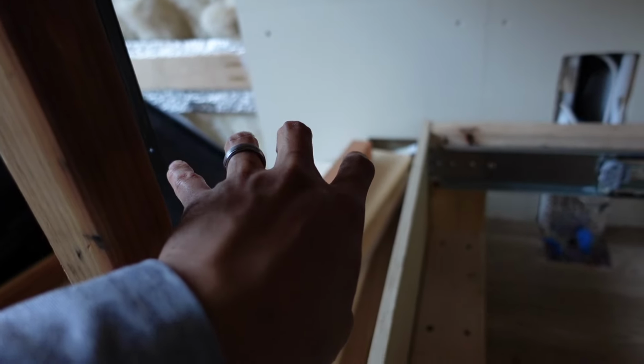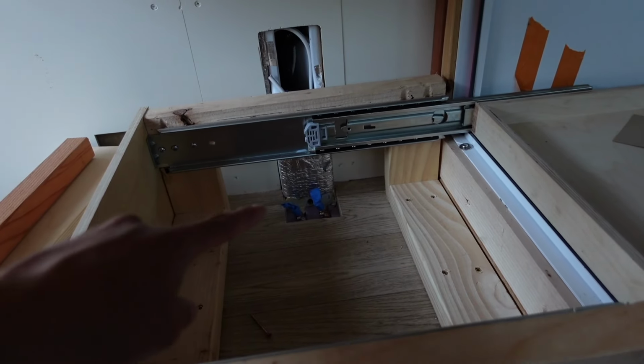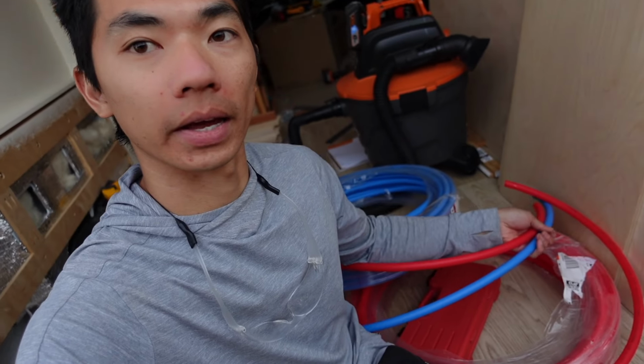Cold water runs into the heater, which is under here. Then that gives us both hot and cold supplies. It'll tee off from here. So one side will go towards our galley sink, towards me. Then the other side will kind of climb up through here, up through this little hole, which I'm hopefully thinking is large enough. And then we can route it to our mixer valve, which obviously the output mixed water comes up to whatever shower head fitting we have here. Here is our PEX tubing.